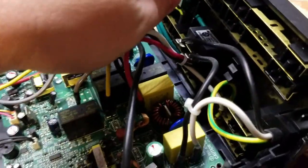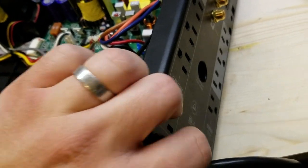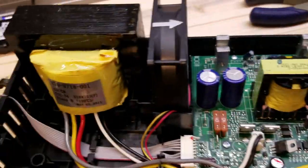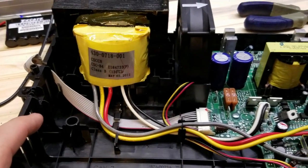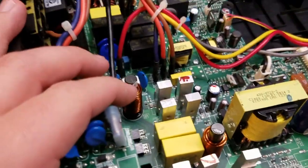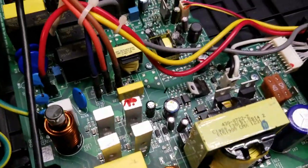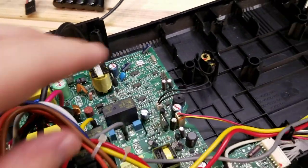We can see the battery compartment has two connections, so we'll disconnect those and get into the meter to start going over stuff. We have some pretty reasonably thick cables for the battery compartment. This back panel here — this is the battery backup rail and this is the surge-only rail. There's a nice beefy transformer there, which I guess means this is a pure sine wave inverter. I've poured over the board and I'm not really able to find anything — no busted MOSFETs, no leaky or bulging caps, no smoke or anything.